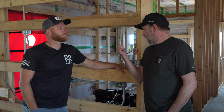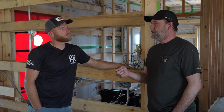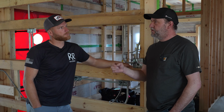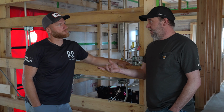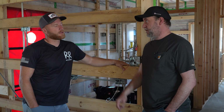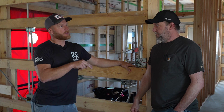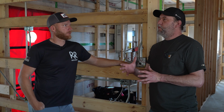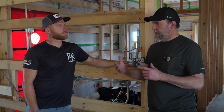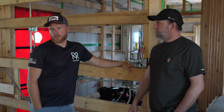Gary Nelson, the godfather of the Minneapolis Blower Door, I had a conversation with him, and he thought that .07, .075 would be the ideal spot for a house to end up. This house is close to a third of that. So even though we had a higher blower door score at 50 pascals, this actually has less air leakage per square foot. Right, because when a house leaks, it doesn't leak in the volume; it leaks on the surface. So that square foot of surface area is actually a little bit better metric. Interesting little thing.